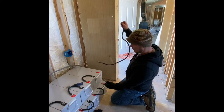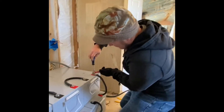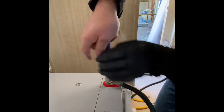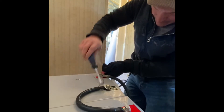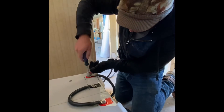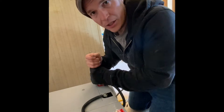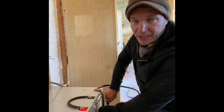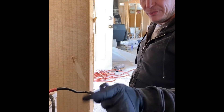We've got our cable that goes to our battery and our cable that comes from our bottom battery bank. We're going to put these two together. You want to make sure all your battery cables are really tight — sometimes inverters can sense when there's a loose battery cable and it really messes the voltage up. So if your inverter's throwing an error, the first thing you want to check is that all your battery cables are good and tight. We're connecting this battery bank to that battery bank, and then we have a wire that goes to our inverter. We're going to do the same thing to the negative side.